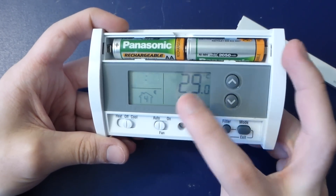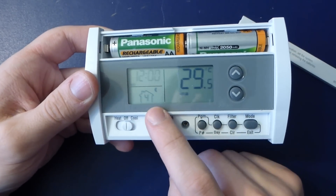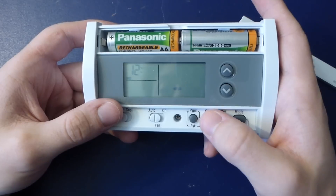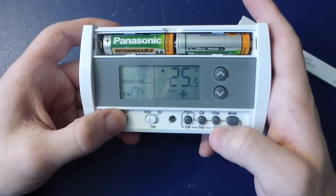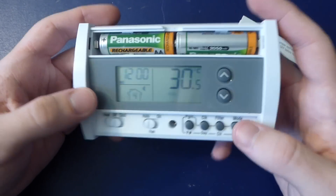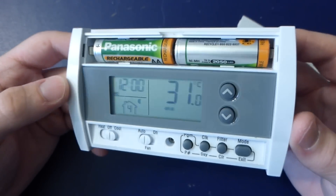It's full, so it makes me think it's probably just telling us it's on batteries, because obviously this is supposed to run off the AC transformer for the furnace. And we've got 'times not set.' I've never used this, so I don't exactly know how it works. You can set the clock, go through the program. I don't think it's going to do anything, because it probably relies on the external power to run the relays. It probably just uses batteries to maintain the program and the clock — because if you don't have power, your furnace isn't going to work anyway.